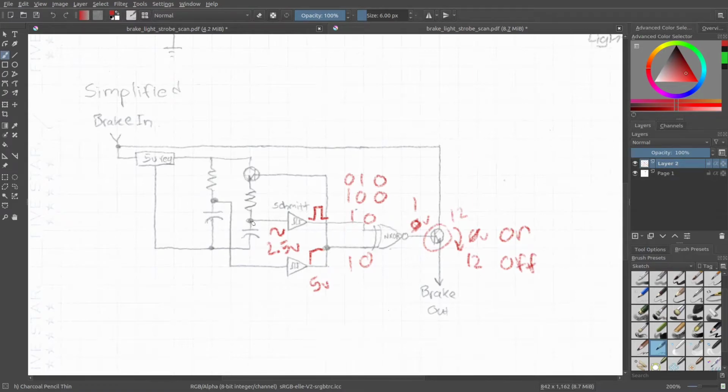Down at the bottom, the first Schmitt trigger also turns on a transistor for the second capacitor, which allows the second capacitor to charge. Otherwise, this represents an infinite resistance and doesn't allow the second capacitor to charge until it's turned on. Once it's turned on, it drops some 0.5 volts and shorts the circuit across here, which allows the second capacitor to charge, which then triggers the second Schmitt trigger, and so on.